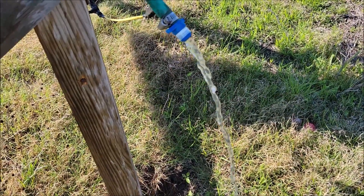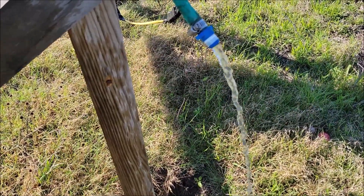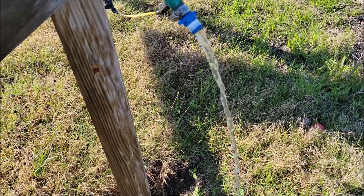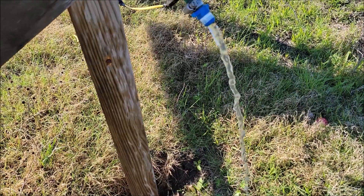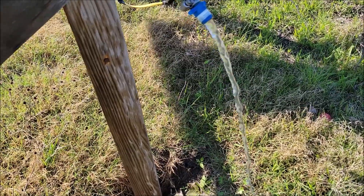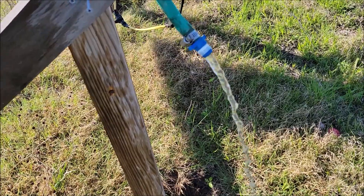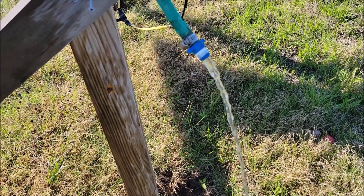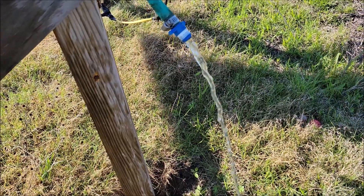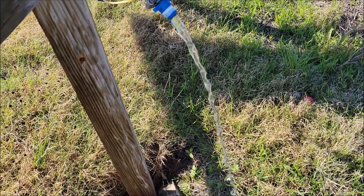The pump has a half-inch hose bib at the end where the water comes out, which is going to pretty much limit the flow to what can go through half-inch. But it's a diaphragm pump, which allows it to lift water. The main reason I bought this pump is because I had to lift water from the pond up the hill 30 or 40 feet, plus run it 1,500 to 2,000 feet through half-inch line. I needed pressure — pressure was more important to me than flow.